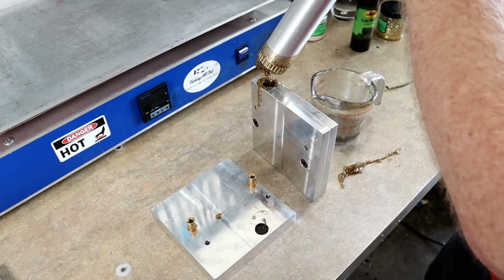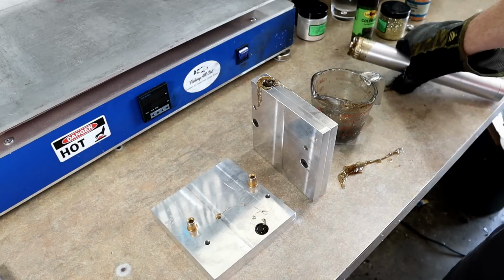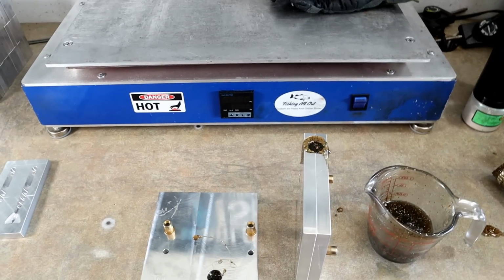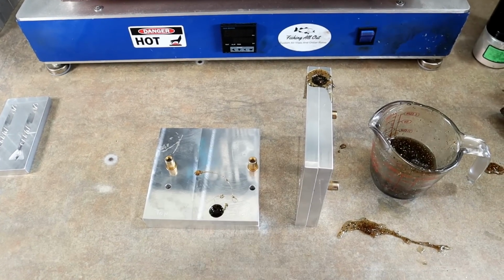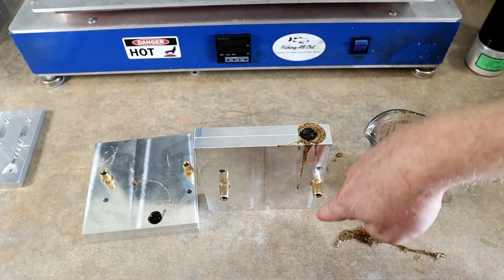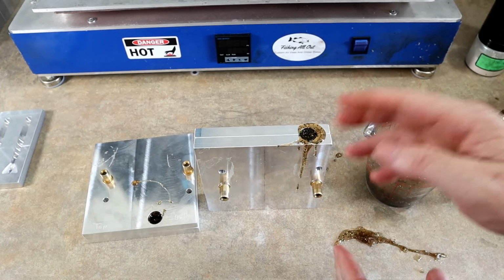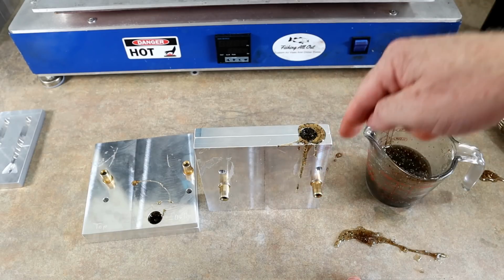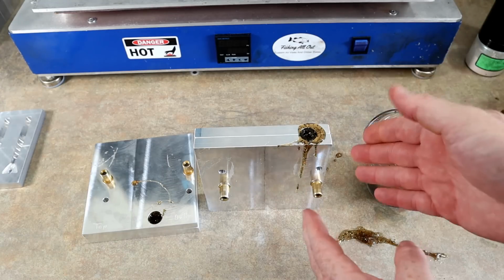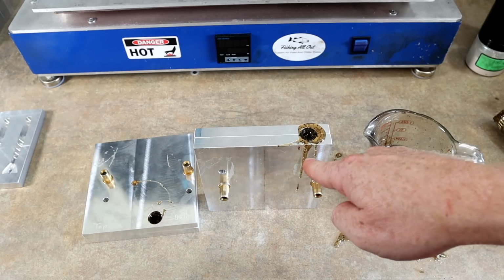Again, this mold configuration on the final version is completely different in terms of how the plastic flows. If we come over here and look at the two molds, a typical injection process in a vertical mold, and by that I just mean a mold that stands up, you're filling the plastic aiming down, so gravity is going to play a factor in the path the plastic takes into the mold. I actually had some clear molds cut by Josh in a video a long time ago where we looked at the exact path that the plastic takes, and basically it fills up in the bottom and then injects on its way up top.